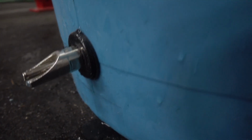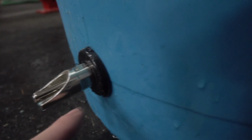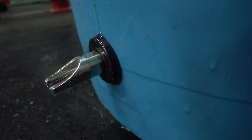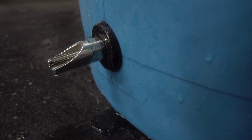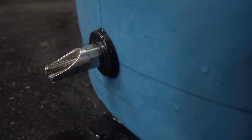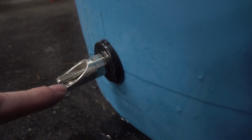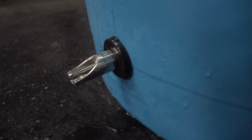All right, check it out. There is a little bit of a leak here still. And there's a leak from underneath the metal fitting and the bulkhead. And I think what I need to do is take those nipples out and use some plumber's tape around the threads. I'm hoping that's going to solve the problem. And then while I'm in there, I'll check that all of those brass fittings are also secure and tight, because once again, it might be the problem that this has a loose brass fitting on the end of it, on the inside. So fun, learn as we go here.